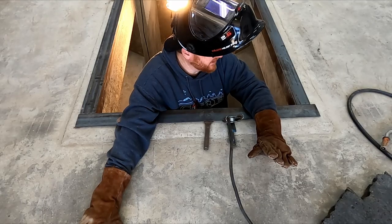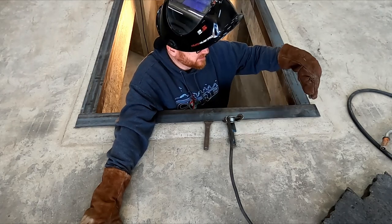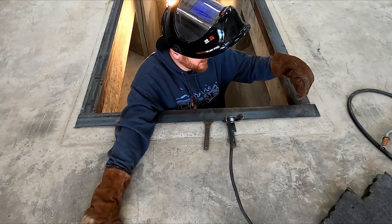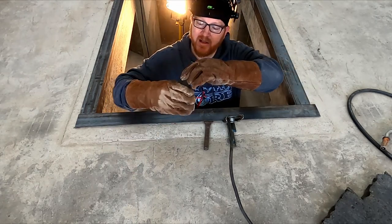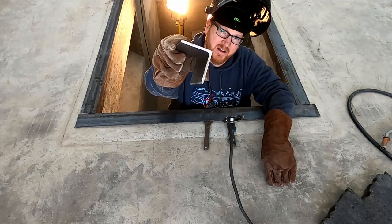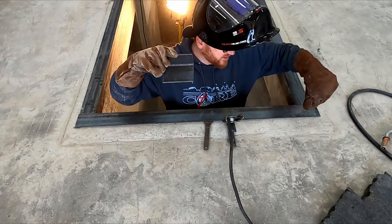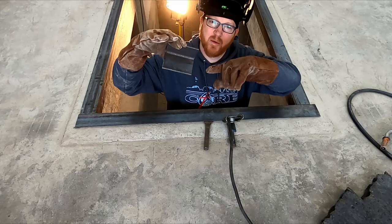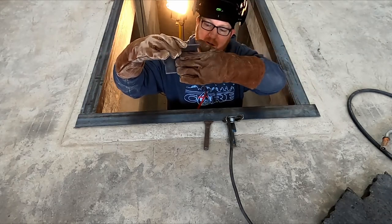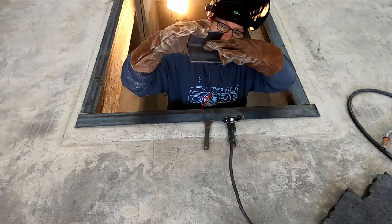We're getting ready to weld here, and one thing I don't want to be doing, when I go to put this back in after we tack it up, is struggling with it to get it in and seat it. Angle iron is not square on the inside. There's a thicker fillet on the inside curve, so this is what's going to hit the square edge of our concrete. So this is why we're going to thin set this in, mortar this in, to create a barrier that rounds that off so it'll have equal pressure where our sharp comes to round.